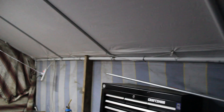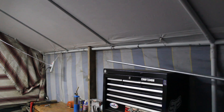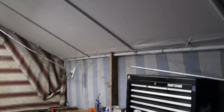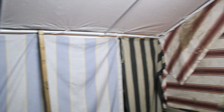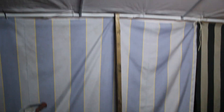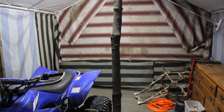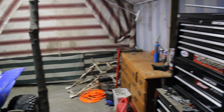These extra rafters — look at the spacing here, that's a 10-foot space from down the end to over here, and I split it. I'm getting about three-foot-four spacing now, which in awning terms is not that great, but I didn't want to spend too much more money. I also added these makeshift posts that hold up the front pipes, and those work out good too. It's basically just a cheap carport not made to handle snow, and hopefully I got it to handle snow. I have all these donated awning materials that I used for sides — that's basically how my shop works.